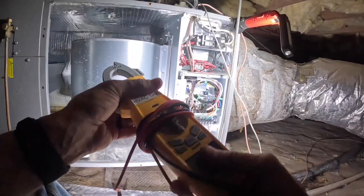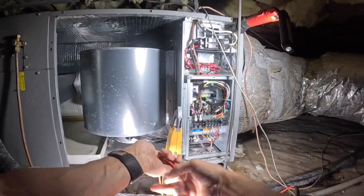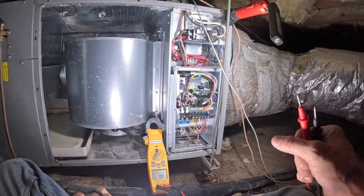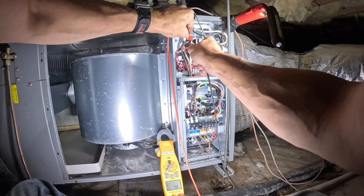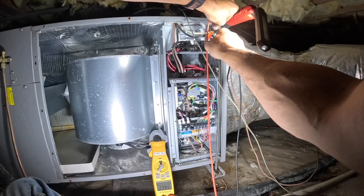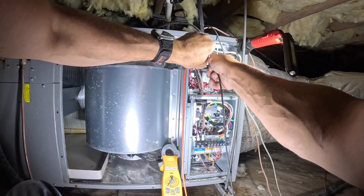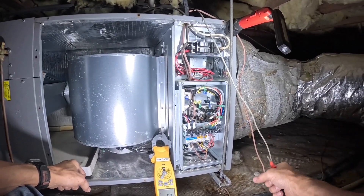Let me get my meter. This one does have 5kW heat strips in it. I wasn't sure about not installing heat strips when I first started installing these, but now around here I don't use heat strips. I've got zero volts here, but 240 volts over there.